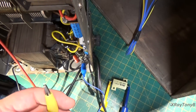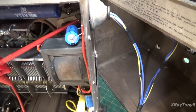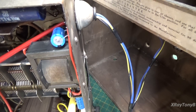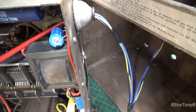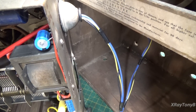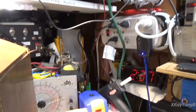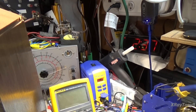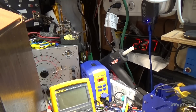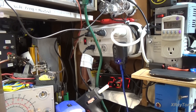I also have a little load resistor — it's a 4.7K, 25-watt. I'm going to put it right on that coil to put a little bit of current load on this, so it will drop the voltage to where it will be when the tubes are all in there. I'm trying to simulate the tubes a little bit, and we're going to turn this on through our dim bulb tester. We have our dim bulb right here and our meter right here. I'm going to turn this on and show you when I plug this in through the dim bulb that the bulb no longer lights up.